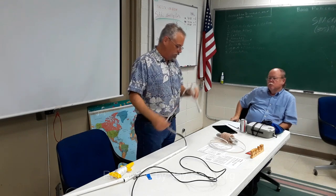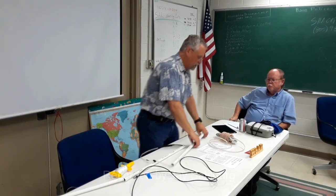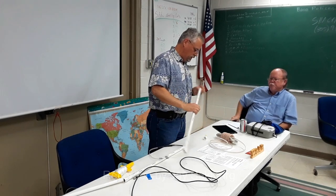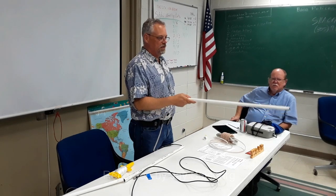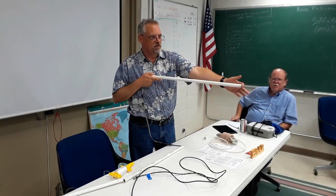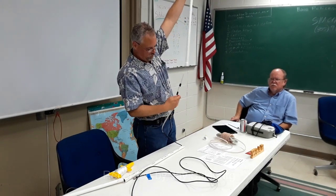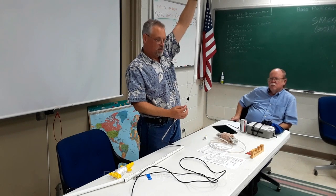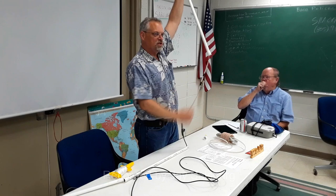So there's a couple different things as a recap. I'm sure that everybody knows this, but we'll go ahead and cover it just as a refresher. I'm suspending the end of the antenna. There's a half wavelength, approximately half a wavelength, or electrically a half wavelength, from here to somewhere around here. Okay? And then you have about a quarter wavelength underneath it. So this bottom piece is the tuning section.